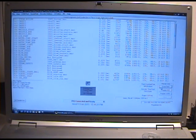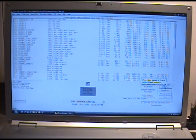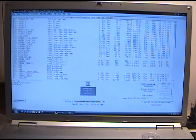Okay, so the first step to that is just to clear out any remains of the sound program that's in there. We're going to use the erase flash button down in the bottom right corner there. And you'll hear that buzzing sound. No, we haven't fried the decoder yet, but it does make a buzzing sound when it's doing some of its reading and writing. And it just takes a couple seconds, and the flash has been erased. We come back down and check, and our decoder free flash now is 524,000 bytes, about a half a megabyte, and that checks. Everything has been cleared out.